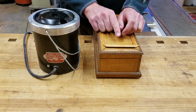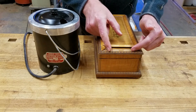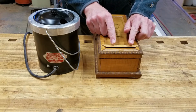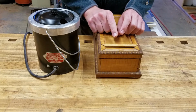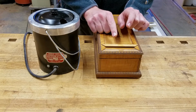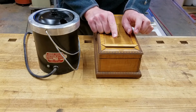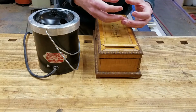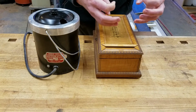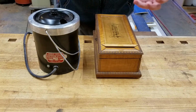Modern PVA glues work by penetrating into the pores of one piece and another piece before the water leaves them, and the polyvinyl molecules in them interweave into a solid plastic. This creates a lot of strength because, in essence, you now have a third piece of material, this vinyl, that is interwoven with the grain structure of two pieces of wood, and that makes it hard to pull them apart.